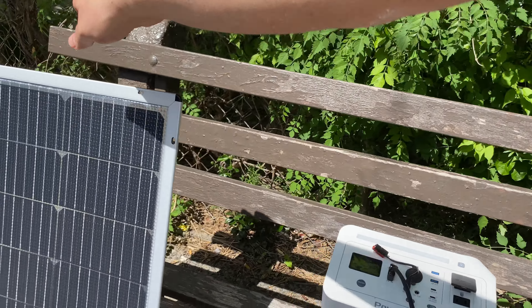It's charging up the 600-watt bank. With me blocking part of one panel, we're getting 95 watts from two panels connected. Now let's experiment — I'll put one panel here and one here at as much of an angle as I can. With me in the middle and the sun slightly clouded, we're producing 123 watts total, with one side producing about 45 watts.